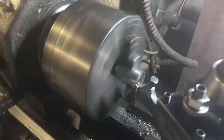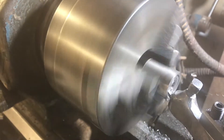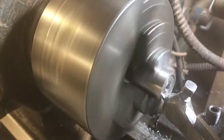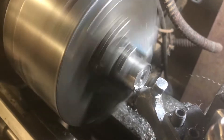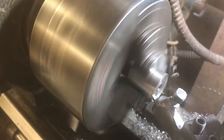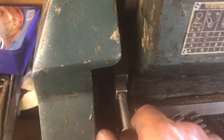Here I'm using a standard cutting tool to do a facing surface — just taking the nubbin off first. I'm using a manual feed for the moment to get the initial feed cut. To make an automatic cross feed cut, I need to turn on the lead screw, which runs along the bottom here. I'll engage it and that will make the lead screw start rotating.